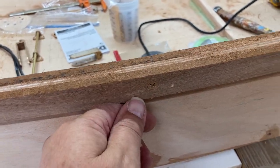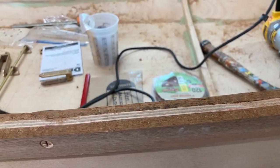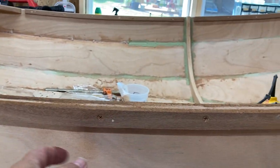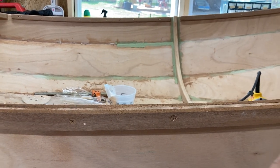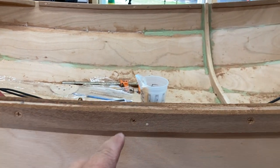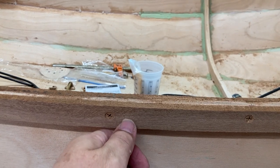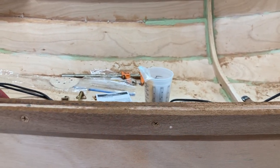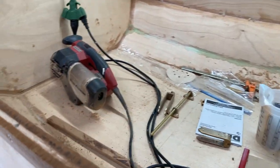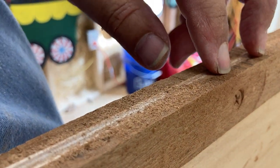Another fastener — that one's okay. So anyway, that's going to look a little different on the outside of the boat. These other fasteners are 12 inches apart, and we talked about that in the last video. There's where I had to sand off these screws, because when you countersink a one-inch screw it goes through more than one inch of material — I went ahead and ran one through from the other side.